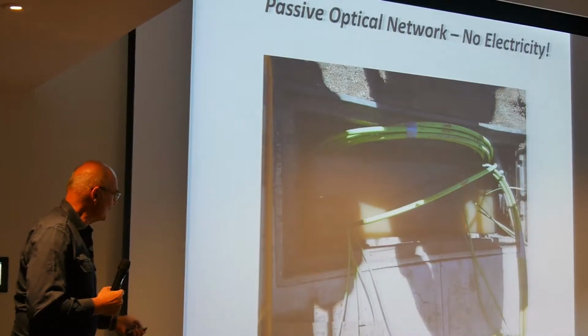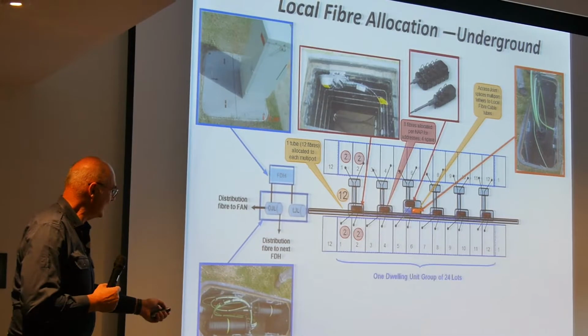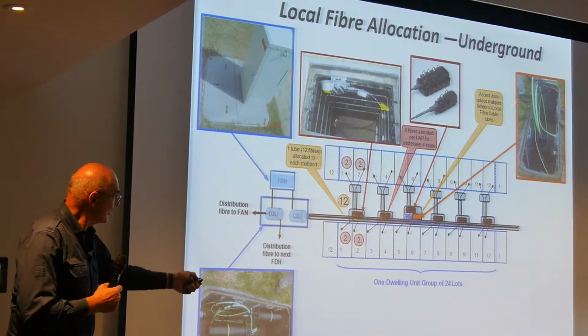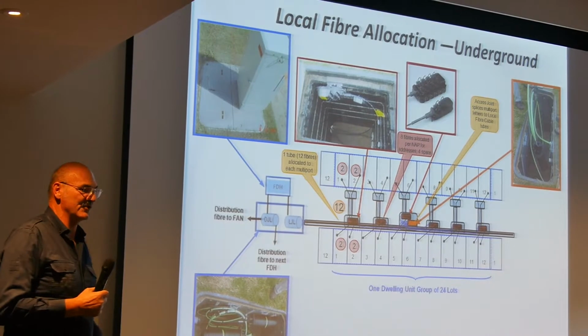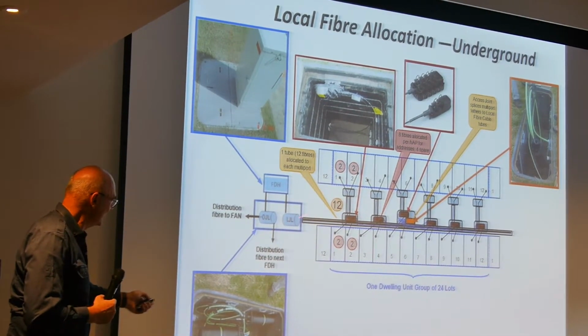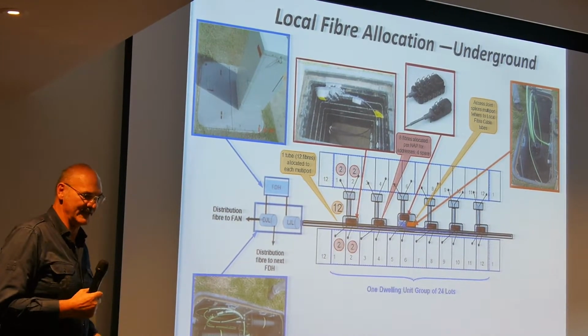The access joint itself is here. So a cable comes out to that access joint, they look like that. And then you come back to multi-ports, these units here, where you actually plug in a drop cable. And it's all plug and play. You splice here, you splice there, all of the rest of it is plugged in when it's needed.